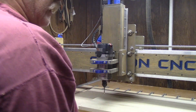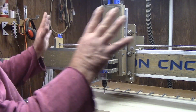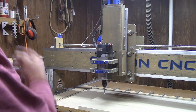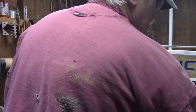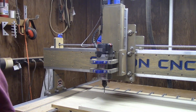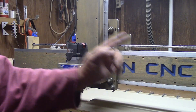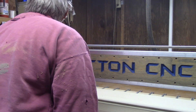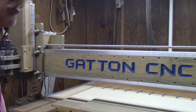I've got my router out of the material, but now since the computer shut down, the controller shut down, everything shut down, my X, Y, and Z zero are out the window — so now I have to re-home my machine. I don't set my machine in the center and wait for it to move at slow speeds to home. I go ahead and bring it up close to where the homing switches are going to hit their triggers — scoot that up close in Y, move my X over, bring my Z up. Now I'm ready to go into machine coordinates, ref all home.